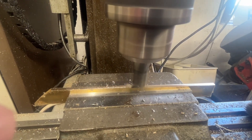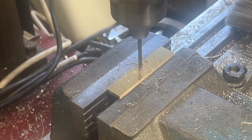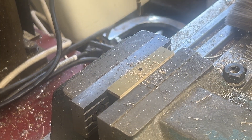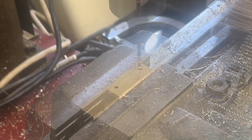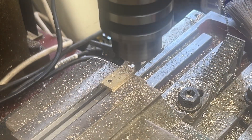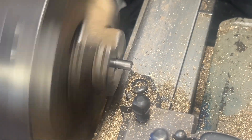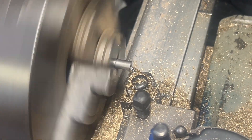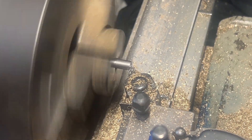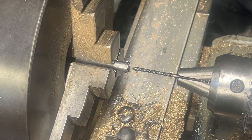In this video we're going to continue with the ticket clock and make the pendulum. Starting out with some sheet brass, we're going to make the top and bottom strip for the upper section of the pendulum. The bottom section is slotted 8mm to accept the compensator. The top section is produced using two 6mm rods of invar, simply turned to size and threaded at the top and bottom to accept the brass strips.